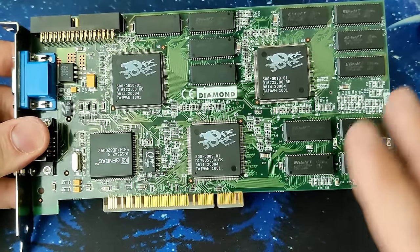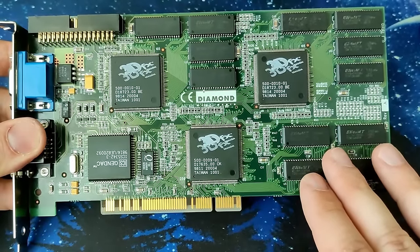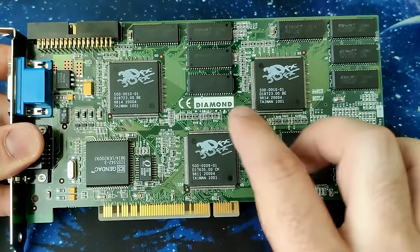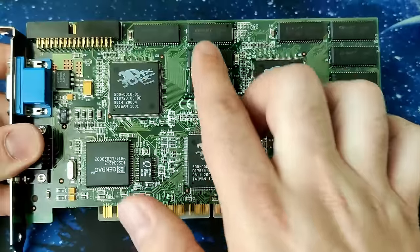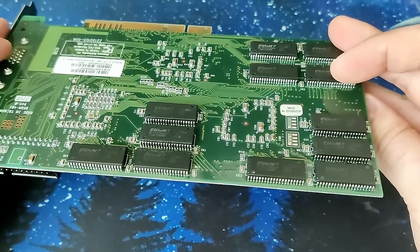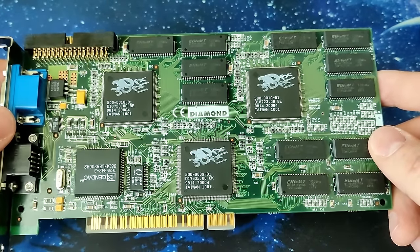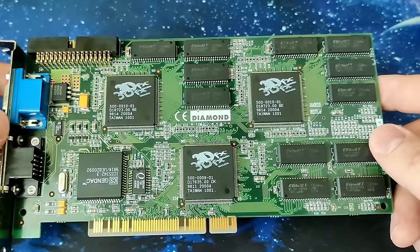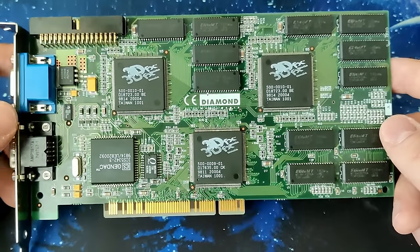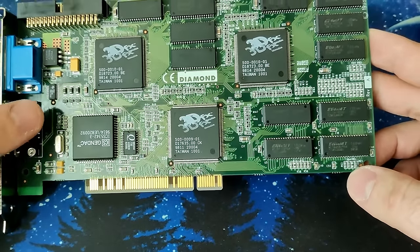So again, the frame buffer chip only sees 1 megabyte so far. Before, these two texture mapping units saw 2 megabytes. That was okay because I only soldered the front memory chips. Now we have the ones on the back as well. Each TMU should now have 4 megabytes. That would at least be something that's good to see. And yeah, frame buffer, that's the problem right now.